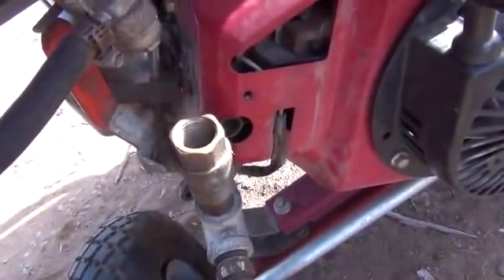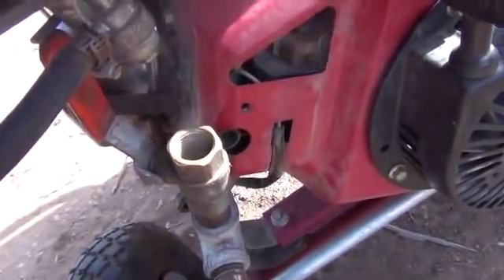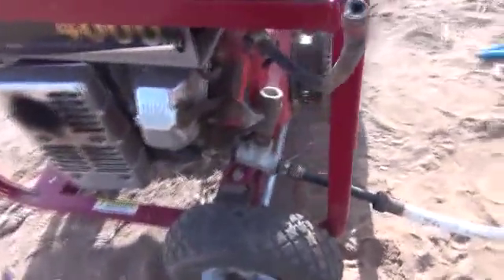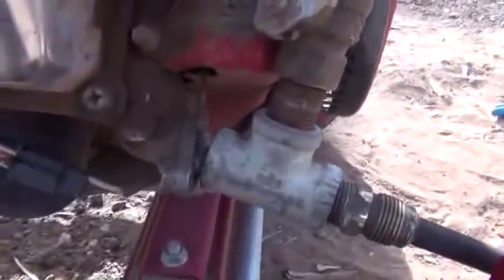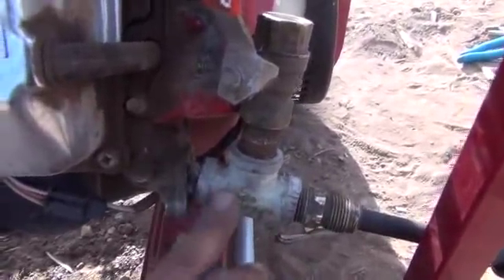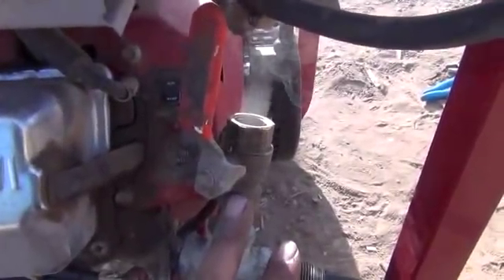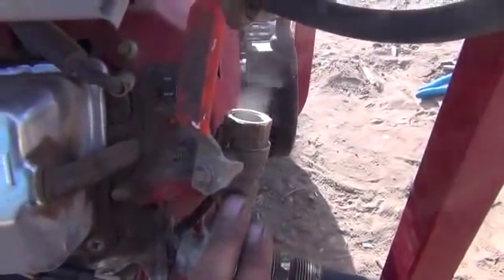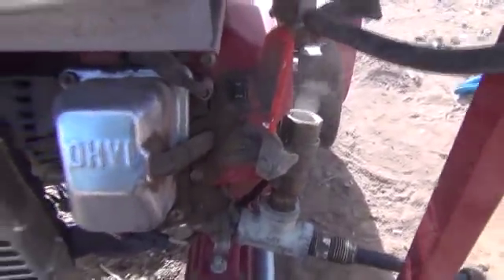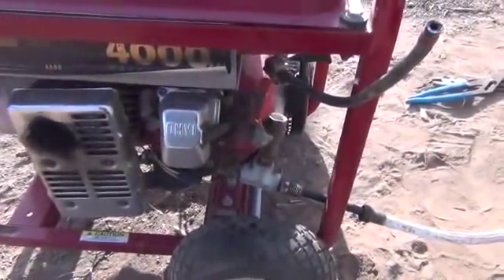You can start seeing more and more smoke coming out of there now — it's starting to produce a little bit of smoke. What we're going to do here is let that get to full syngas production and then I'm going to fire up the generator again so you can see how it's working. Once again just to show you — all the carburetor has been taken off. The carburetor was bolted to here. That's just a T — gas line coming in — and this is so it can blow by while you're firing up, and to adjust for fresh air flow after you've got syngas production when the generator is fired up. Give me just a moment, let that gas fully produce, and I'll turn the camera back on and we'll start this thing up.